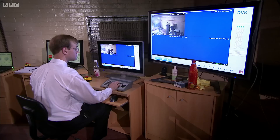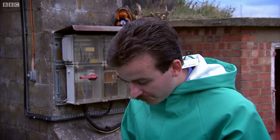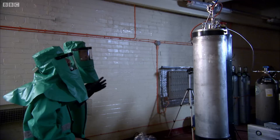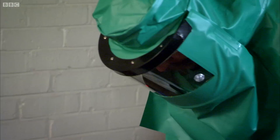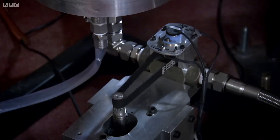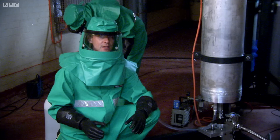Working out how to achieve this perfect mix has been the main challenge for Daniel's team. Firing up a rocket of this size is seriously dangerous, so it's a real privilege to be taking part in this test. For the Bloodhound rocket, our oxygen source is something called high test peroxide, or HTP. Although it's fairly stable and non-toxic, it still needs to be handled carefully. What we do now is sucking the hydrogen peroxide into this tank here, then once it's full, we seal it off.